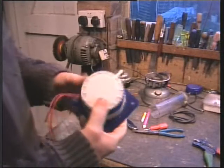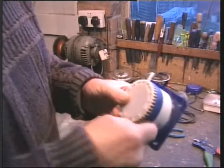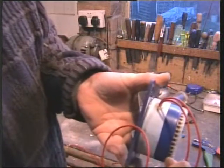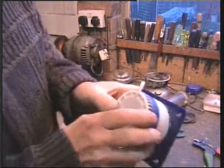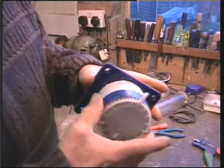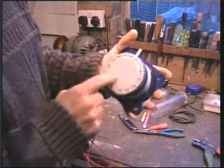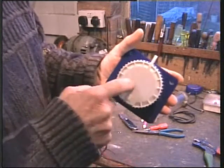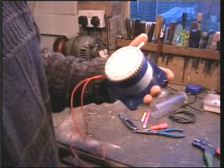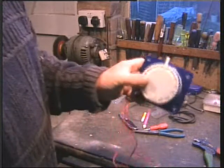Okay then, well, that's the finished item. I've used hot melt glue on the inside of the tube, on the outside of the tube where the wire comes in, on the inside and on the outside. I've epoxied the unit down onto the tube. I've put self-amalgamating tape over where the joint is, and that can be fitted to the bulkhead under the floorboards. And if that lets water in, I will publicly eat my hat on YouTube. No, I think that's absolutely going to do the job.